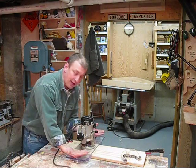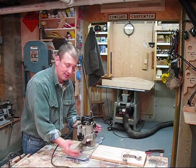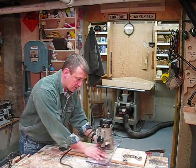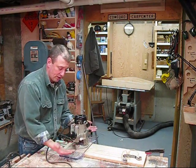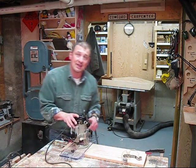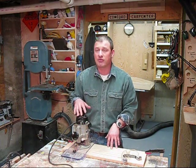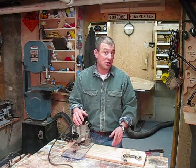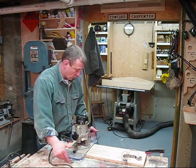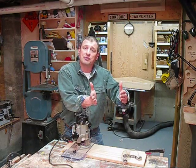The jig has these two guide edges on the side — two guides and two knob sets that tighten and slide in and out. It allows the jig and the router to basically slide up and down the board, and the guide edges hug the side of the board and ride the edges. This jig will allow you to route dados in a board from one inch to almost 12 inches wide, and you can use it to do curved or arch trim as well. You turn the edge guides around where they have ball bearing guides, and the ball bearings will follow the curve of the trim.